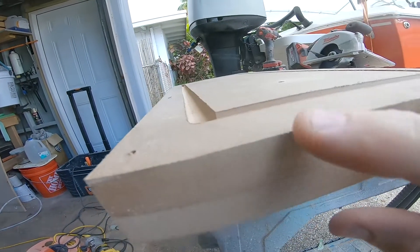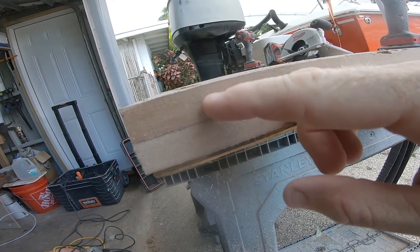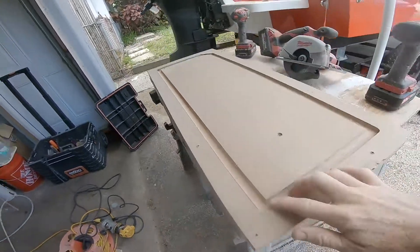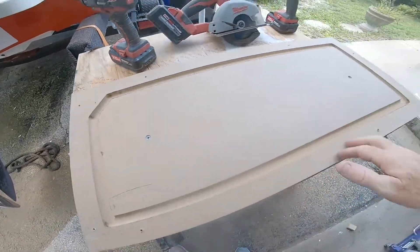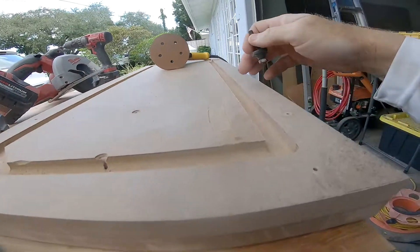You can see here I've adjusted all my cuts and now my gutter portion of the mold is about a half an inch deep. You don't want to go through the top piece because then the center piece is going to separate, so make sure to not go more than a half an inch. Here in the corner I cut that little angle which will be used for making a water drain.